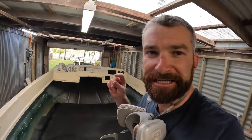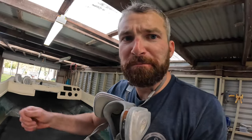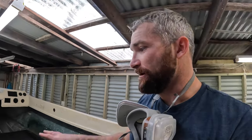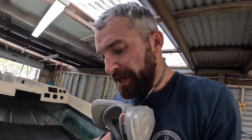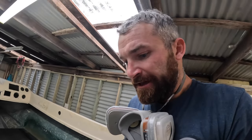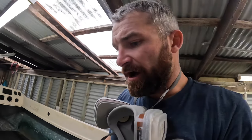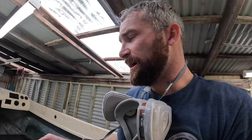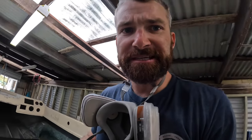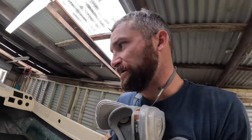You'll notice there, guys, I did two washes with the acetone. It's just because after sanding and blowing with the compressor, which is a great way to get rid of those granules of thermalite. Now, I sanded that with 40 grit, so that's enough to key it up for the resin to bond. Now, I'm gonna go along, as I mentioned before, and fill all these little holes, but obviously this process is to prep it first, and that's why I did the acetone wash, a two-stage acetone wash. So I went over once, and then again with clean rags.